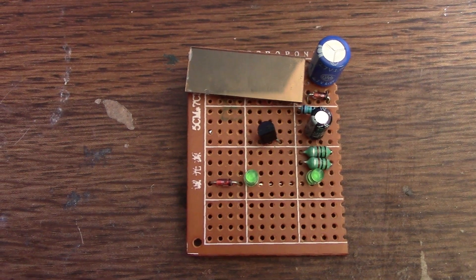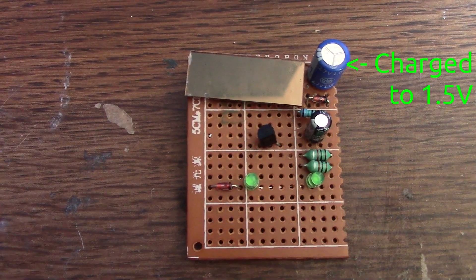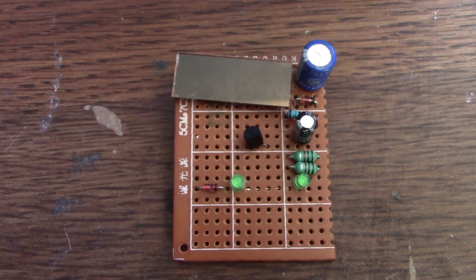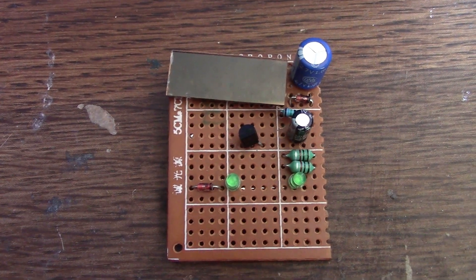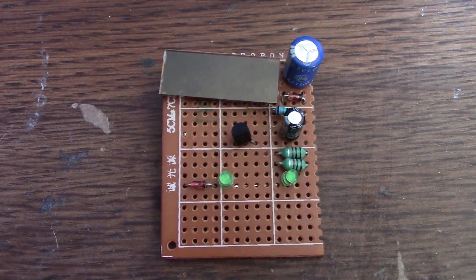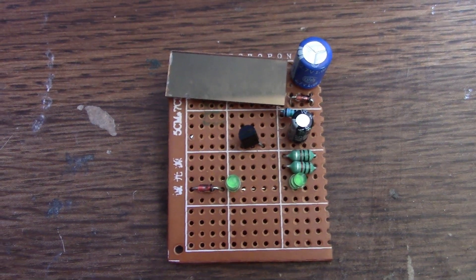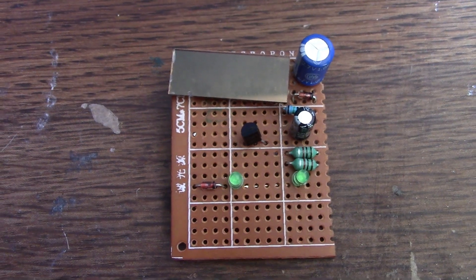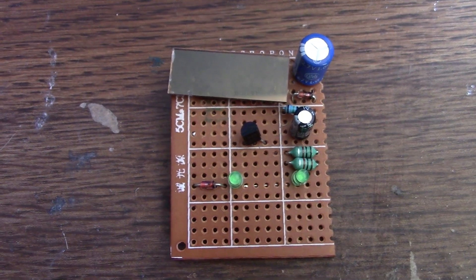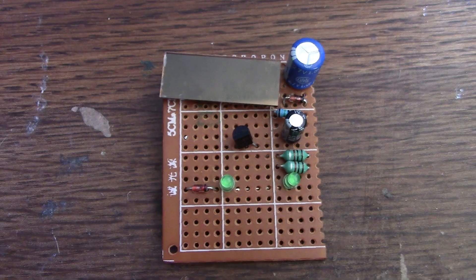Now, as can be evidently seen, I've connected up the 2.7 volt 1F supercap and the circuit's running absolutely fine, doing what it's supposed to do with some very bright flashing of those green LEDs. The circuit does certainly work as described, except I've changed those two inductors to be side by side, more like a conventional blocking oscillator. The diode there on the bottom left certainly does do the trick of making it flash.